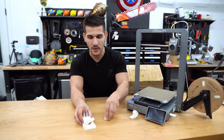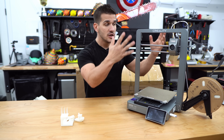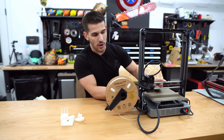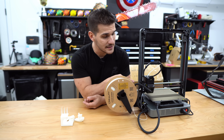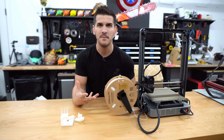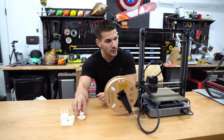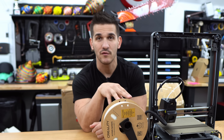I do now have one major complaint. As the printer comes up for calibration and then lowers back down, it pulls a bunch of filament up, and as it lowers, the filament just bunches up and gets tangled with the cable. It's just not the best design — I feel like there absolutely could have been better ways to do this. Can I move the filament runout sensor to the top and bolt the spool holder up there for a direct feed? Modifying it like that would probably be easy, but for a $400 printer, you really shouldn't have to. This shouldn't affect printing as the filament gets fed and pulled, it should untangle itself — but this could have been designed better.